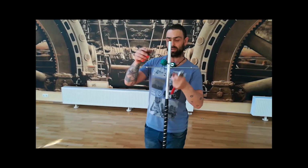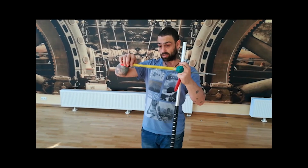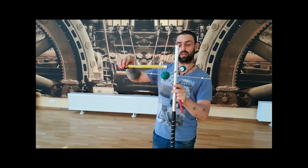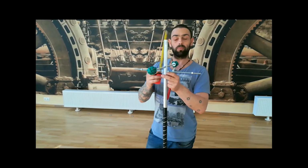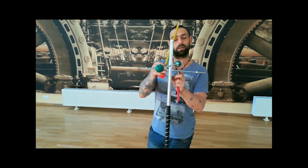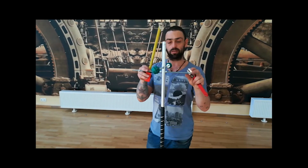But what I want you to do is just double check that it's even. So just go from the outside of bolt to the end. So I got 178. 178 on that side, 178 on that side. So because it's not that tight, I want to kind of do both at the same, like I want to do a couple with this one, couple with this one. But if this was 80 mil, you want to really tighten with just the one, okay? And make sure they're even.